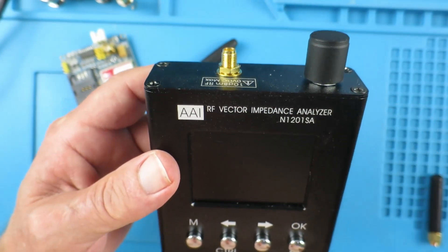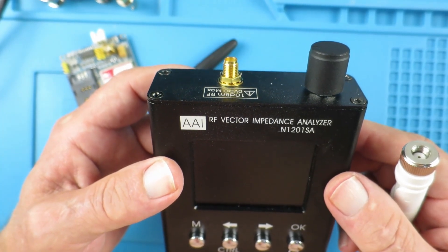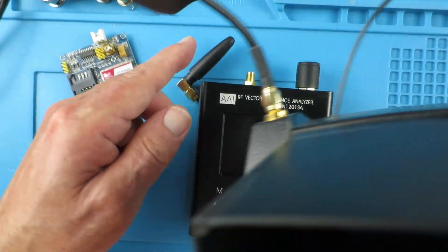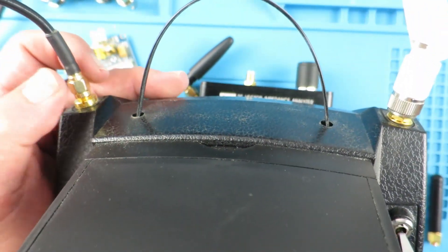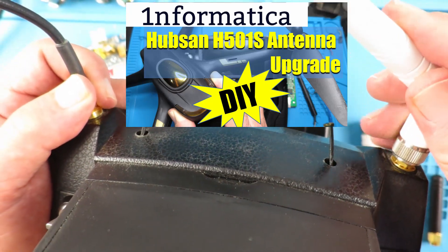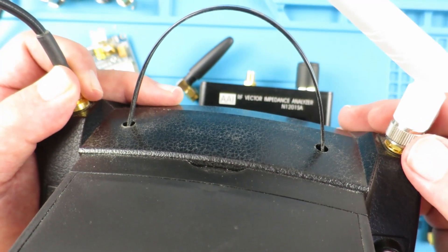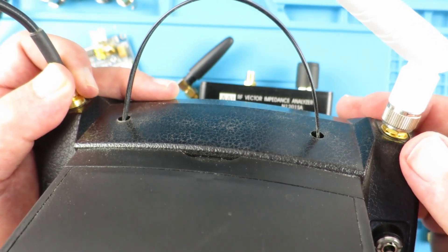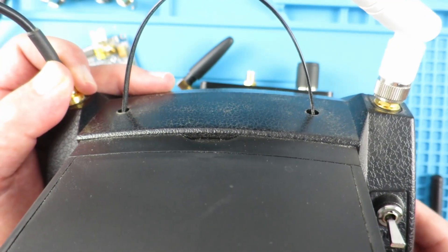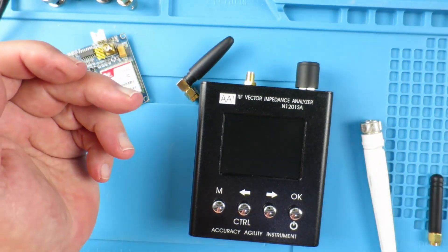For me, trying to test this antenna on my impedance analyzer, that was no big deal. But what would happen if I put the wrong antenna on my quad? I would probably pass a close-range test because there will be some coupling even though it's two sockets - it may work until you fly away and then encounter a loss of control. For a quadcopter traveling at some speed, or a fixed-wing aircraft, this could ruin your day.